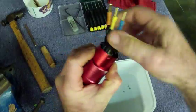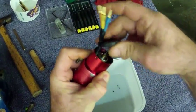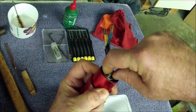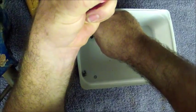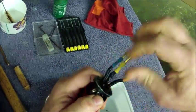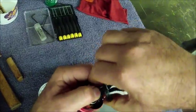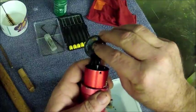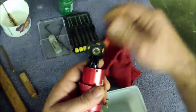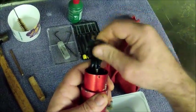Keep your motor nice and vertical. Now you've got to watch here because on the back of the shaft we have some spacers. Take those spacers off very carefully and put them somewhere safe so you remember which ones they were and where they went — that's for the back shaft. Just work the wires out of the way to get the back plate clear. There's our bearing — you can see the dirt on it; it's not fully rusted but it needs cleaning up. There's our back bearing, and there's our rotor and drive shaft.